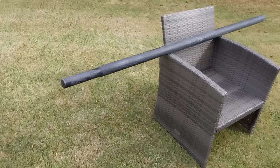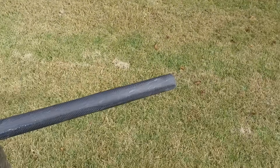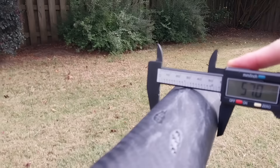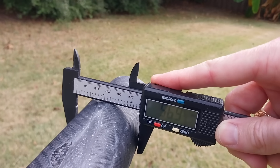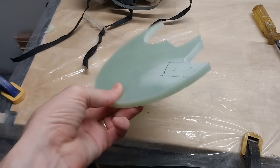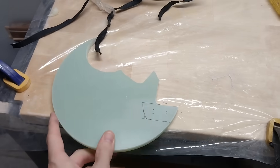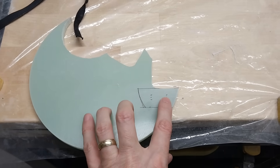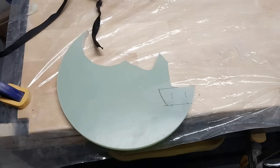After sanding and rinsing, I'm letting it dry. The diameter before was 51 millimeters at this end — let's see what we got now: 57 millimeters. We've added six millimeters, even better than I hoped. Next up I've got this very serious-looking piece of G10, one centimeter thick — super strong. This is going to be the pad eye for the downhaul of the sail, with a hole for the roller reefing line that rolls up the mast and reefs the sail.